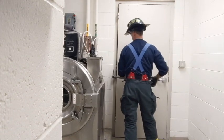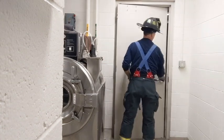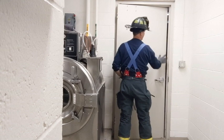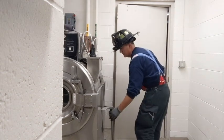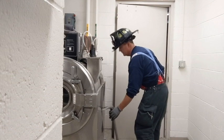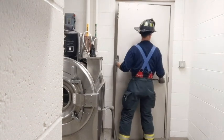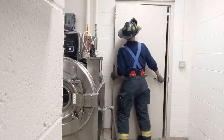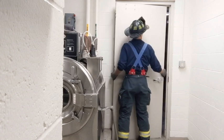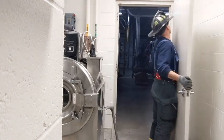The last lock is here — you're going to see it drop out shortly. You've got to envision that if the deadbolts were engaged, there's going to be a little torque on those right now. So what I would do is, with the hinge side of the door away from the jam, you're just going to kind of walk it away from the latch side until those deadbolts clear, and then you can remove the door entirely.